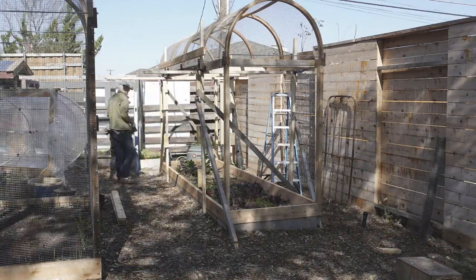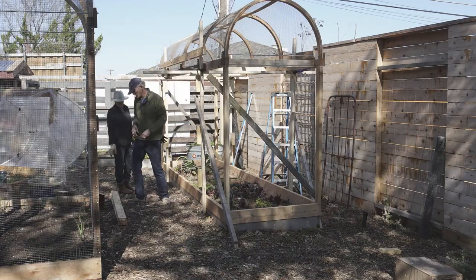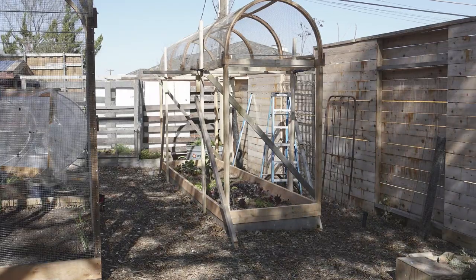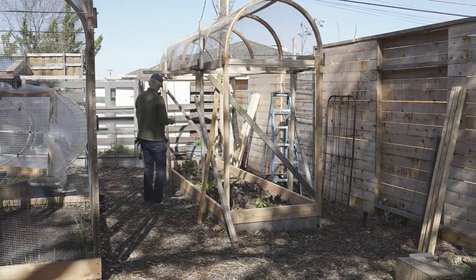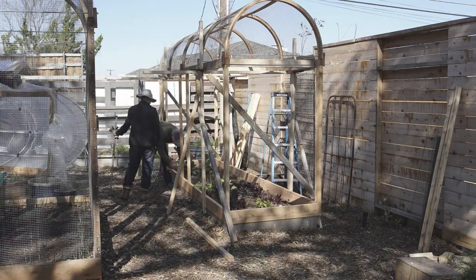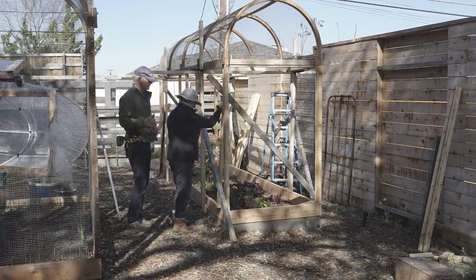Now comes the time to fill in the additional pillars. We take some of the scaffolding lumber and remove it, we don't need it anymore since we have the corner posts, and cut it to fit into the additional pillar spaces. Once those are cut and fit, and we add a little cross bracing to make sure that all stays in place, we have a completed structural support that we can then wait for tomorrow to add the doors to.